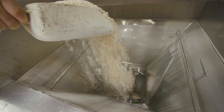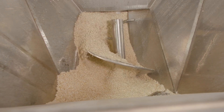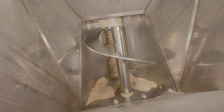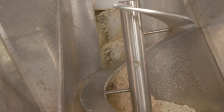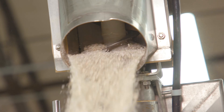Product is poured into the hopper. A large spiral agitator helps move product from the hopper into the auger tube. Once product is in the auger tube, a smaller spiral blade inside the tube rotates to carry product to the discharge. Product will exit the discharge and move on to the next process.